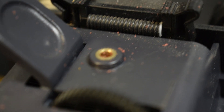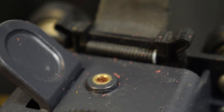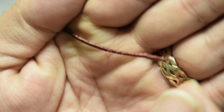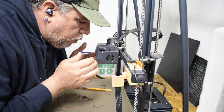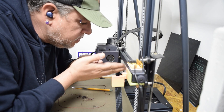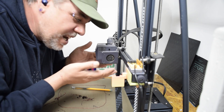As you can see here, this thing was grinding. Just grinding. Look at all those little red and pink specks all over — it was just chewing on. The gear was chewing on the filament as it was going through. Let me get my tools out and we're going to take this thing apart. It's a Monday. It's always a freaking Monday.